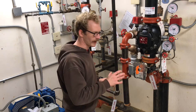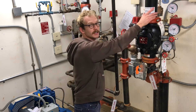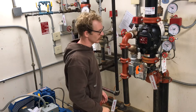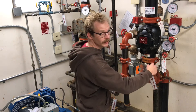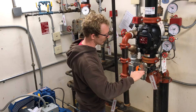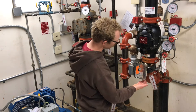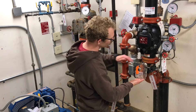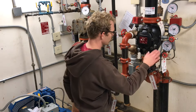If we have a power outage and we can't keep pumping air into the dry system, the first thing you want to do is close this valve here all the way in. This orange flap will be horizontal, indicating that the water coming from the city is unable to move into the system and flood the dry system. Step one.